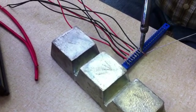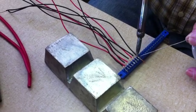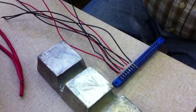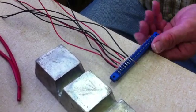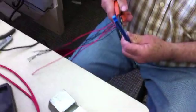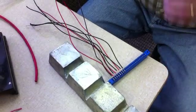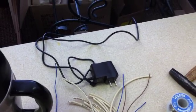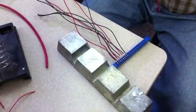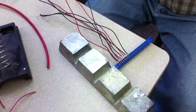He's going to go ahead and solder both ends, and this is what you do for all the pins except for pin 11, which is the ground — you just do number 11, not the M below it. On number 12 you do a positive and negative from your power supply, which you can use the Digitrax one like we have here, or any similar one rated to the right voltage, which you'll find in the manual. We'll pick back up when we go to put the BDL168 on the component board.